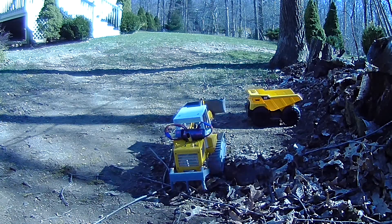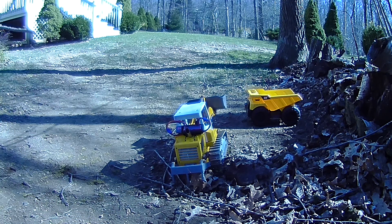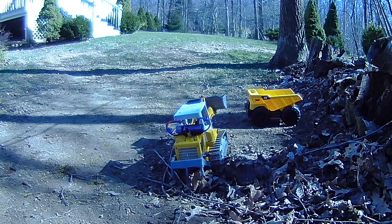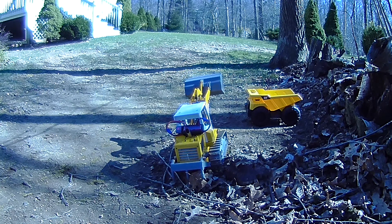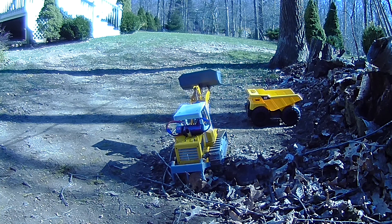There are a couple of little things going on with this. I have a little alarm for the voltage. There is a little cross-talk going on with the ripper. That's fully up. What I've noticed — and I don't know if there's a mechanical bind or if the zero isn't set quite right on the ripper — is that when I bring this all the way up and go to dump, I don't get the full stroke of it dumping. If I keep trying to dump, the ripper will move. It's almost like there's some bleed-through or back pressure somewhere that I have to sort out.